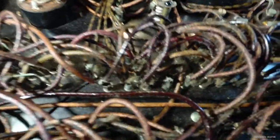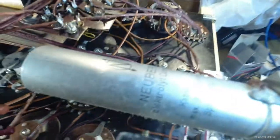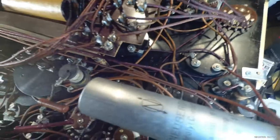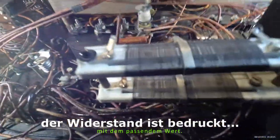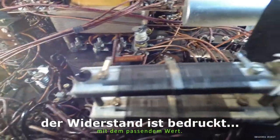Otherwise, a bit of dust — that's still OK. At this age, also some rust. The capacitor I haven't tested yet. What I forgot to mention about the top: there are also coils there, so you have to be careful that nothing touches them — rewinding would be quite a bit of work, especially without knowing the values. I should measure and record them before something happens.